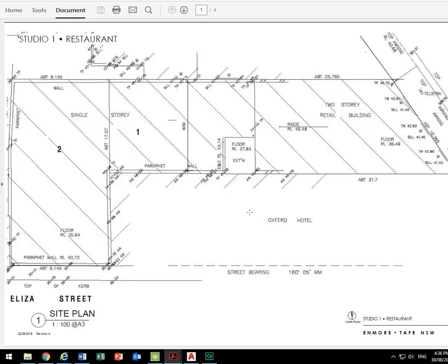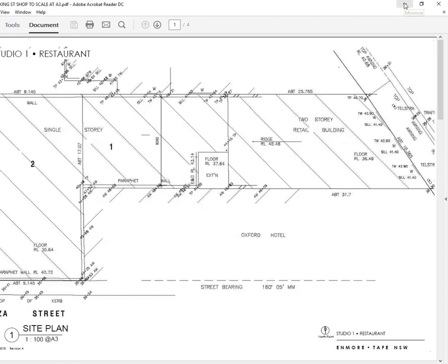Pretty much, yeah, in this case. But we only need to draw two: the two skins of brick and then the cavity. And you don't even need to show the cavity. We just need to know the total thickness of that wall. So it's nice to make it into a round number as well. So 300 is a good thickness for an existing wall like this. And that's what we'll do unless it gives us any other measurement here, and I don't think it does.